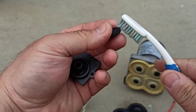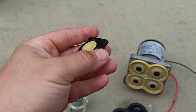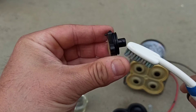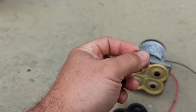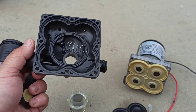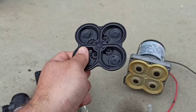I just took a toothbrush and scrubbed along the edges. Anytime you take apart an old pump, you should replace all the O-rings. I don't have any spares, so I'm taking the time to use some warm water and a toothbrush to scrub all the surfaces I can. You should do that to the inside of the housing if there's any buildup, and wash off all the components as best as you can.